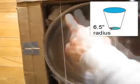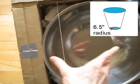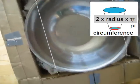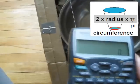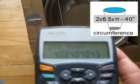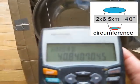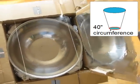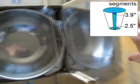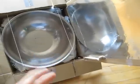Now we know the radius of the bowl — the bottom of the cone — which we measured as 6.5 inches. Using the same formula, 2 times 6.5 times pi gives us 40.8 inches for the length of that circle. We already know we're going to have 16 segments, so dividing 40.8 by 16 gives us 2.5 inches. Now we know the dimensions of our segments: 3.9 inches wide at the top, narrowing down to about 2.5 inches at the bottom. So we know we need 16 segments and we know the dimensions.